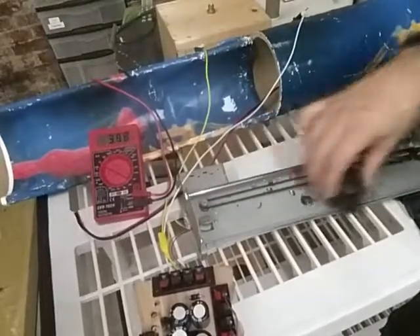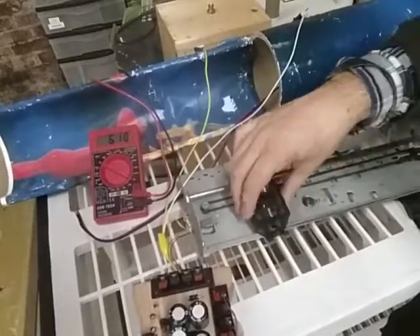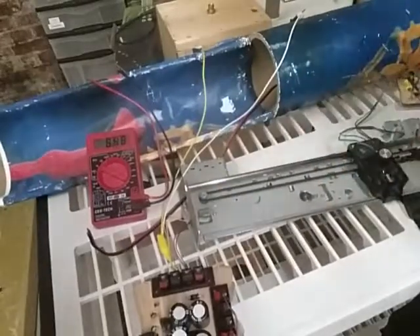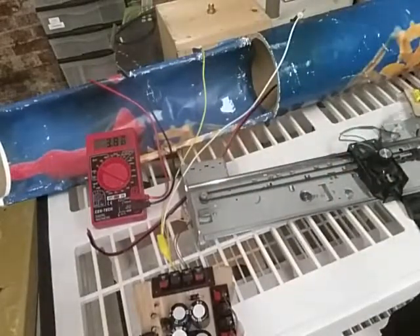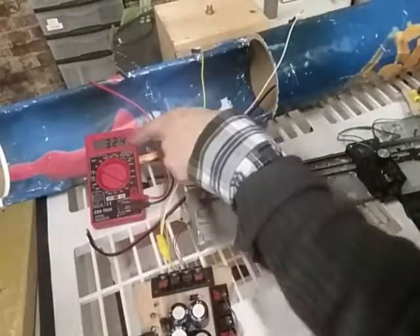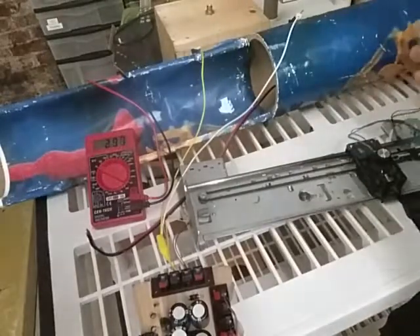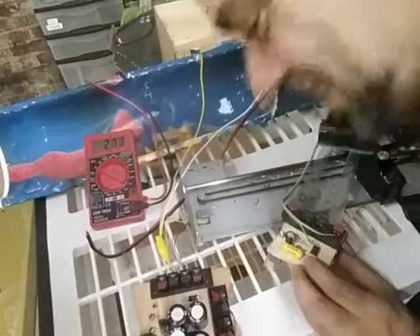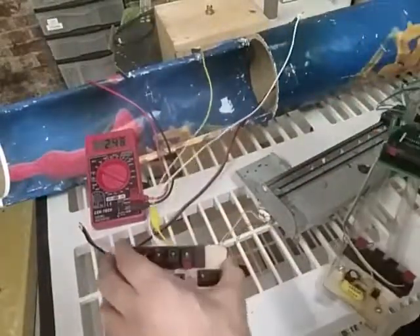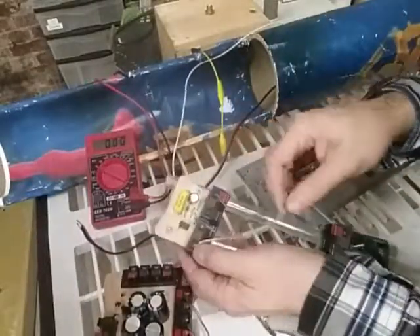We peaked up at 5. Let's move it back — when you're playing it, you move like this, almost like a guitar. We can see we're hitting about 8 volts at peak. Notice it decays slowly. We made it this far, so let's push our luck and see if we can use this to drive the voltage regulator.